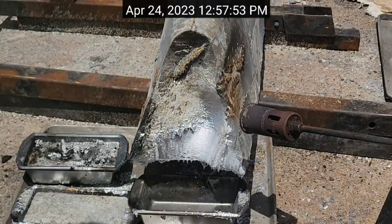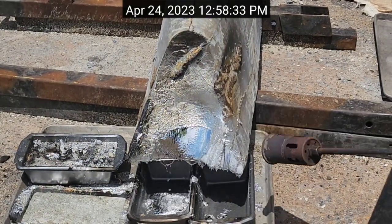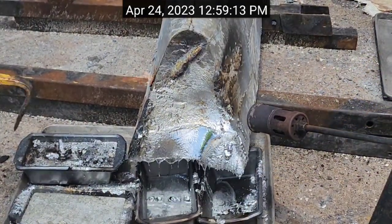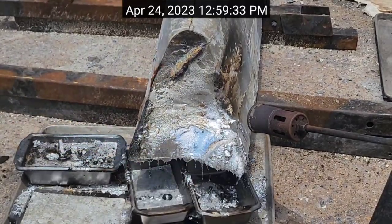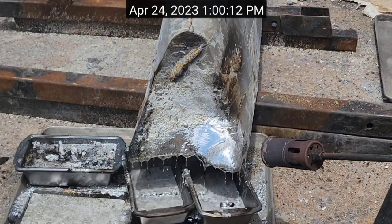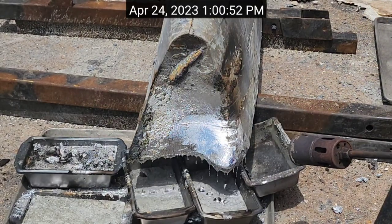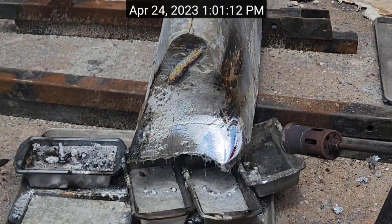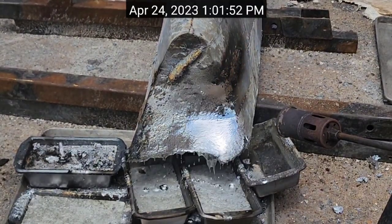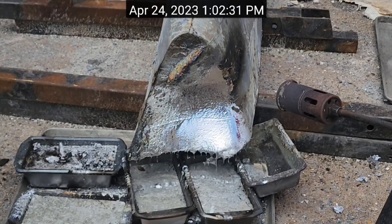They would put things in there to make sure everything would hold together, especially when they were putting in different layers. As you can tell on this block, you see that bottom layer, there's a line cutting across the lead right there. Well, there's another one further up. And right at the very top of the lead where it's melted down, there's something starting to show right through there. When we're going through this, we have to melt down pretty much every single bit of the lead to get it to where it'll fall into these pans, and also pull out all the impurities that are in there.